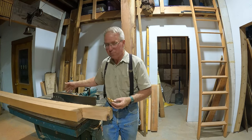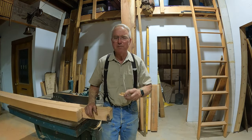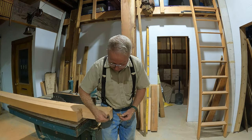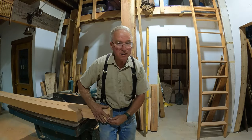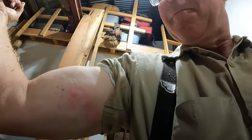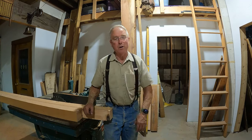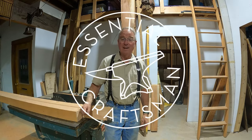The rotary three-phase converter is a resounding success — this saw's got all the power it needs. But as we were coming out of the cut, you see that knot right there in that Douglas fir? Well, the pressure of the saw cutting overpowered whatever was holding that loose knot in, it came out, banged off the inside of my arm, and flew across the shop. It's just a little reminder that a table saw will hurt you — and this is not a SawStop. Every time you walk up to this thing, it's time to be on guard. Thanks for watching Essential Craftsman, and keep up the good work.